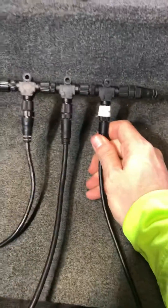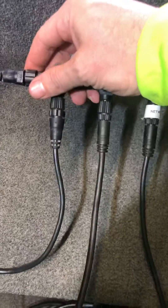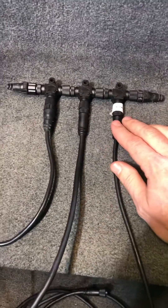So the backbone kit is this set of T's. Each of these is a separate piece. And then on the end, you always have to terminate both ends with these resistors — mine say 120 on them — but you need at least three T's to make this work.